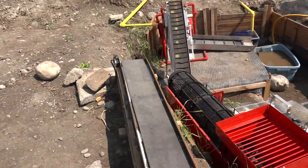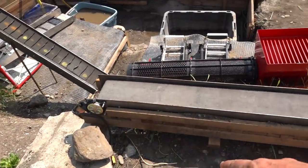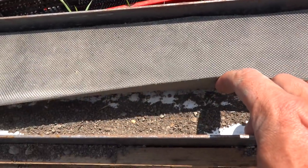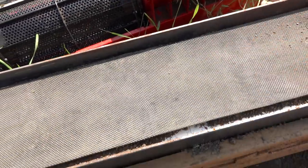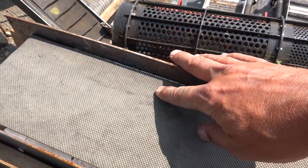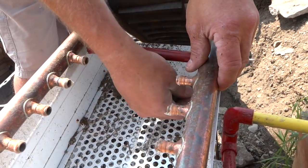In the meantime, I am going to start working on the skirting issue of this conveyor belt. This is the conveyor where Sluice Fox was loading it up with the excavator in the last film, episode nine. The problems we were getting is that pay dirt is actually getting underneath the conveyor. I couldn't find any more of the rubber right now, but I did have some two-inch flat lay water hose. I'm going to make a skirt over the top so it lays on the conveyor belt and stops the rocks from going underneath. This PEX slides on these manifolds very nicely, but we've got to get this shoe goo off of it from our last application of nozzles.